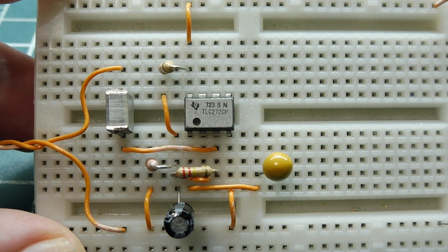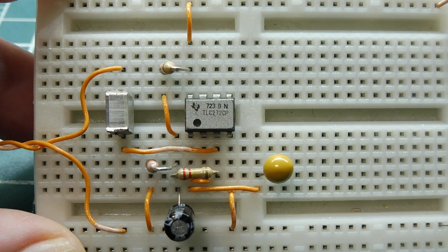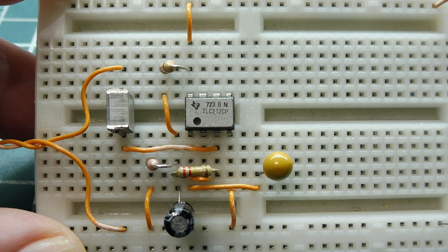We're going to wire this op-amp up as a unity gain voltage follower — the transistor equivalent would be an emitter follower — and it has a very high input impedance. So if you have a device that puts out an AC signal and the signal is small and fragile because it has a high output impedance, you want to buffer that signal. You feed it into an amplifier with high impedance so we don't load it down, and we buffer it for further processing. Basically it's a high-impedance to low-impedance converter.